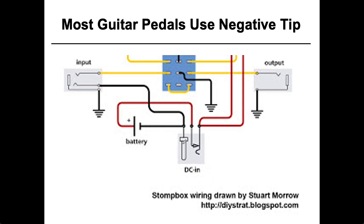Now let's talk about the DC input jack. This is the tip of the DC jack, and this is the ring. This schematic notation indicates that if you don't plug anything in, there's a connection internally made that connects the positive of the battery to the bits of your circuitry that want power. But when you plug something into the jack, this default connection — called a normal connection — is disconnected, and you're getting your power from the outside world. Notice that when you're using an external supply, the battery is disconnected, so you're not trying to power something from a battery and an external source at the same time, which is a bad idea, especially if they are at slightly or not-so-slightly different voltages.